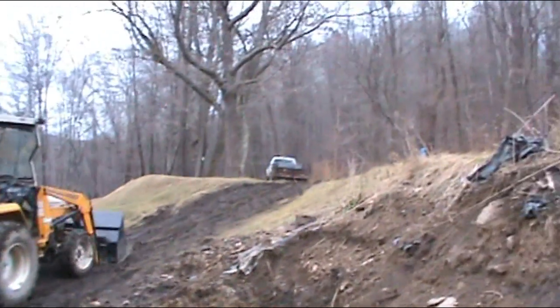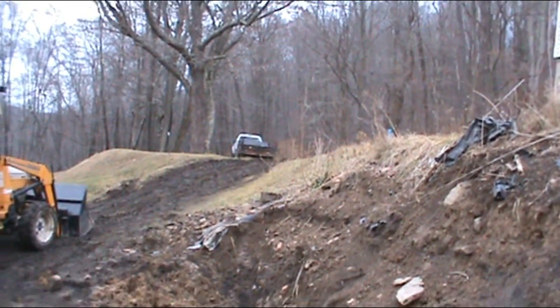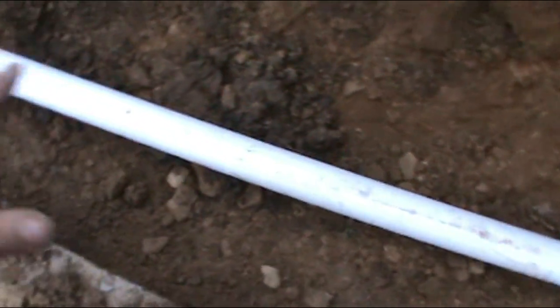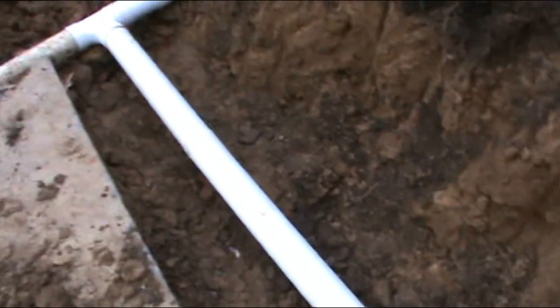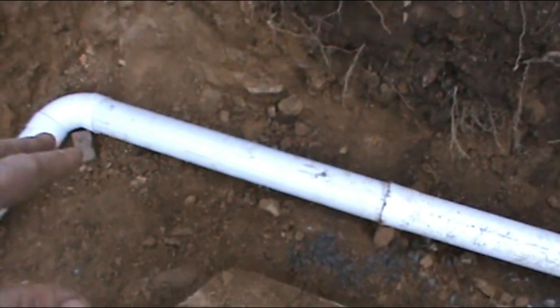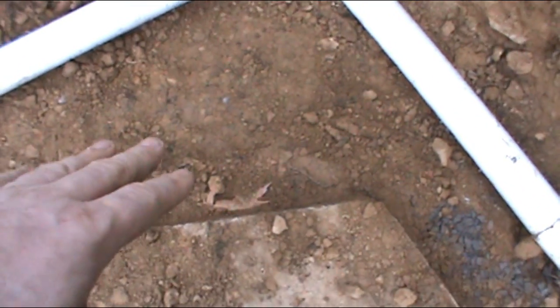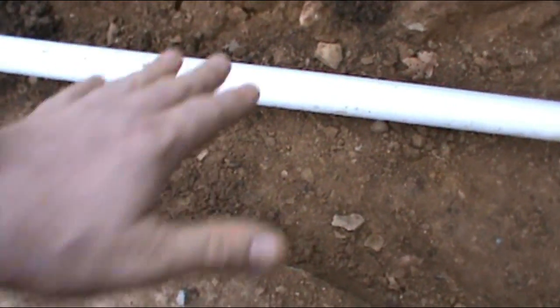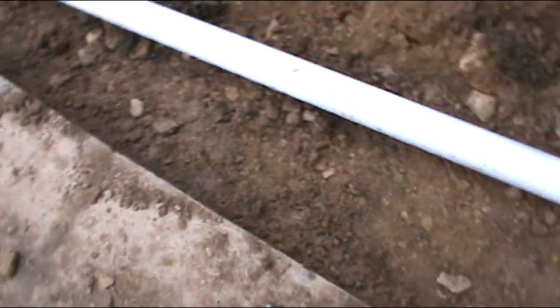I'm gonna take my backhoe, about 4 ton of 2B up on the hill, and I'm gonna start loading it off and filling this in. I'm gonna bring this all back up nice level and then set my ties in. I should have a tie going across here and across there. Plus, with it being recessed to the back, whenever water does get in my ties, it should flow back away from, not lay up against, which is spectacular.